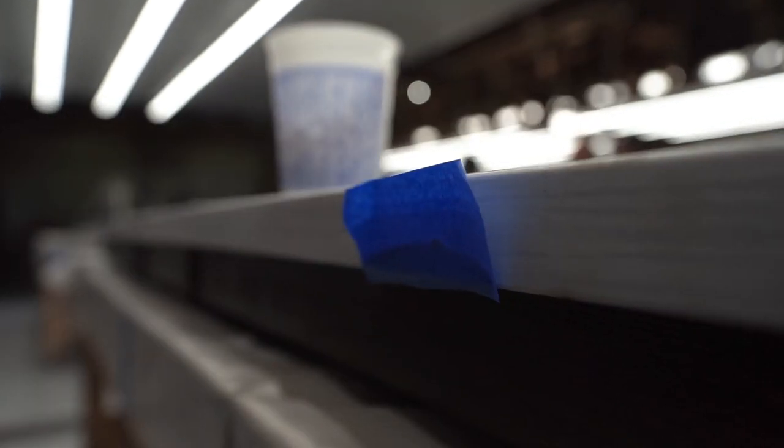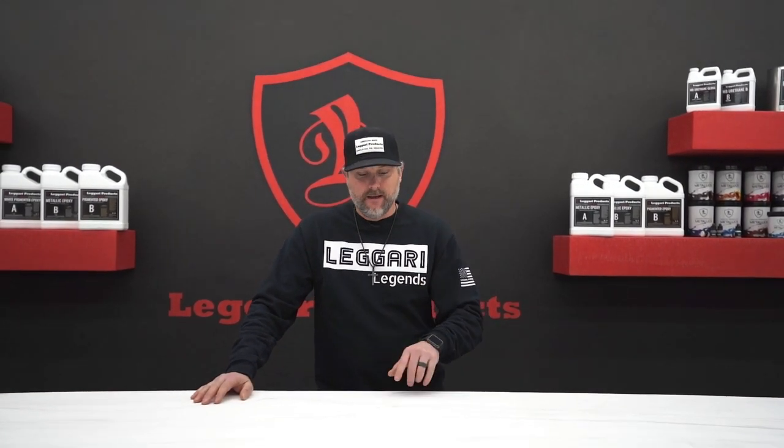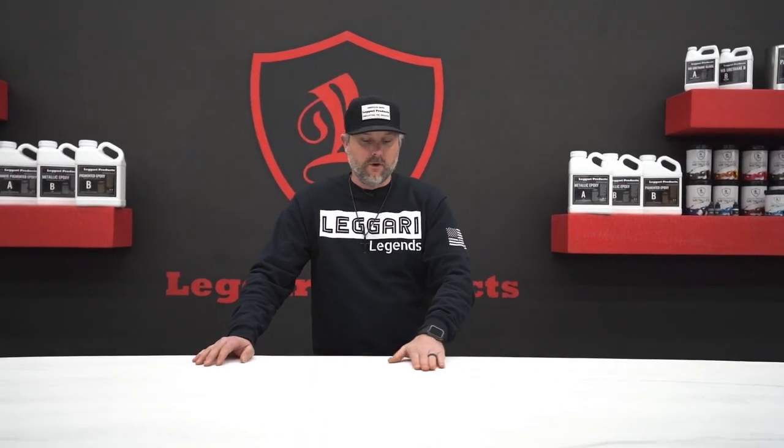All right, guys, so we're gonna let this set up. Once the resin's hard, I can sand it, pull the tape, sand it flush, and then we can apply our top coat. The repairs we did are hard, so now we can sand them. We got the top ones done. We got the faces done, so I'm gonna go over sanding.